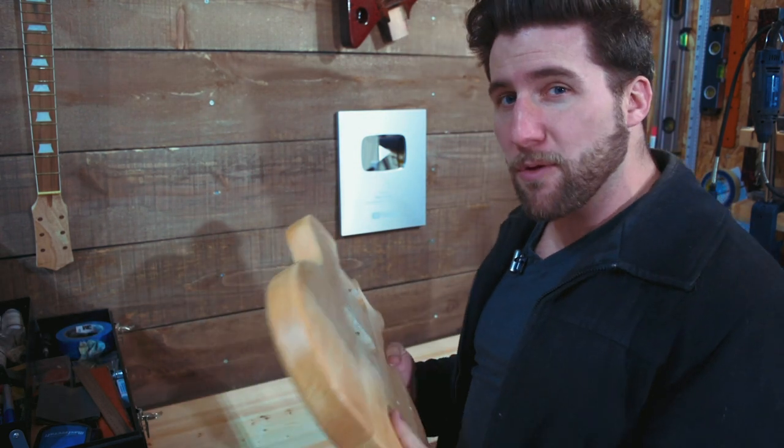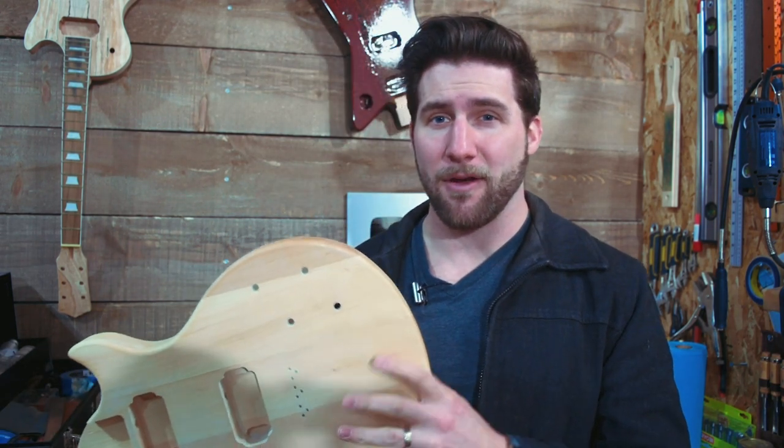The grit you use is going to depend on what your next step is. If you are sanding your guitar for stain, a lot of people say you need to sand with 220 grit so the stain can soak in. I haven't found that to be the case — I usually use dye instead of stain, which is finer and more transparent. For stains, I've found anything up to 400 grit is fine; you start to get a little less absorption in the 600-800 grit range. With dyes, 600 or 800 grit is just fine — the dye soaks right in between the wood fibers. But check your stain cans; they do tend to say 220 grit.